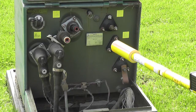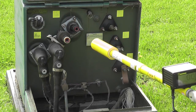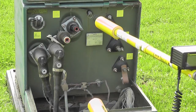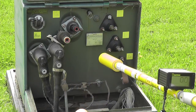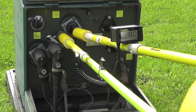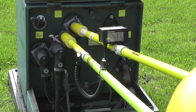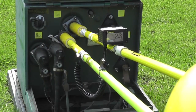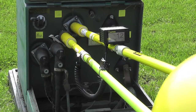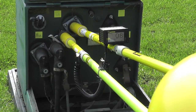This is a demonstration of a good cable using our hypot adapter. We'll plug the non-metered unit on the feed through, and the metered unit will be plugged into the source end. We can watch as the charge equalizes from our parked cable to our source voltage. We started at about 8 kV and it's down below 1 kV, so this demonstrates a good cable.